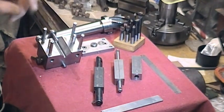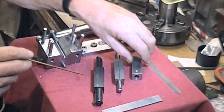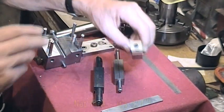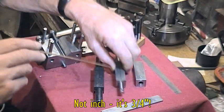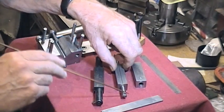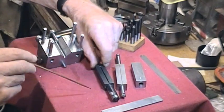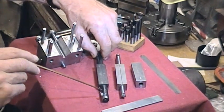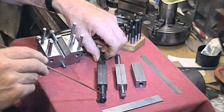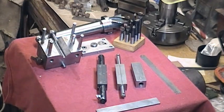Another short project that came to mind recently was to do with setting up my boring bars in the tool post. Generally I use just a piece of prepared inch square stock. I have a couple of holders: one has a set screw, one has a slitting cut that tightens and clamps the piece. Another was bought as a complete unit with a slitting saw cut. I have to use shimming for most of my tooling in the four-way tool post.